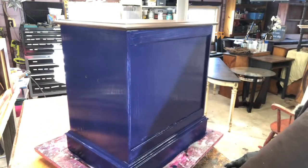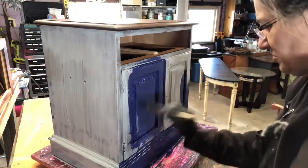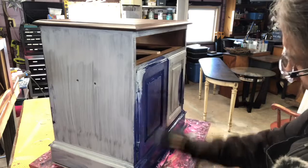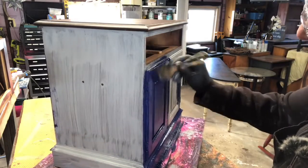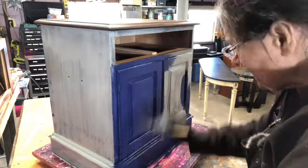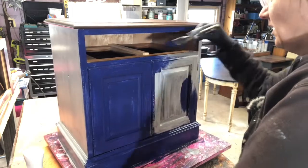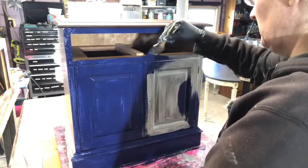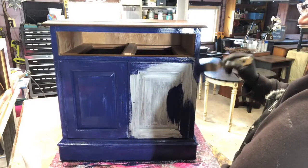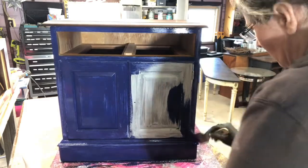Go back, make sure you don't have any drips. Always make sure you bend down and look up because the molding underneath always gets missed. If you think it's getting a little dry, hit it with the mister. If you keep the brush flat, you won't push it into the raw wood and make a mess. Every time you do another coat of paint, it's going to cover that, so I wouldn't worry about it.